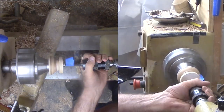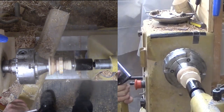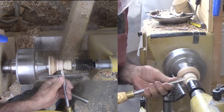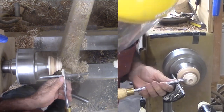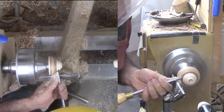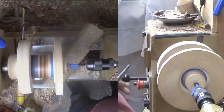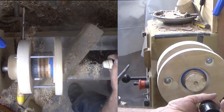With that glue dry for the base, I am drilling for the mortise before I forget. A half-inch mortise should be sufficient. Then I turn down the new ring and do the final shaping — this is spindle gouge territory for me. With the base sanded, a little shellac brings the wood to life. Same thing for the bowl — this is still mounted in my donut chuck, which makes for tight quarters. Drill for the mortise and shape similarly to the base.